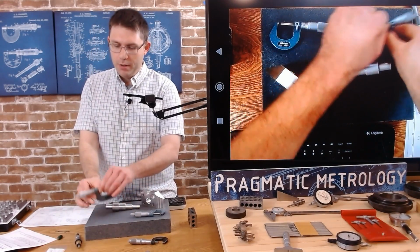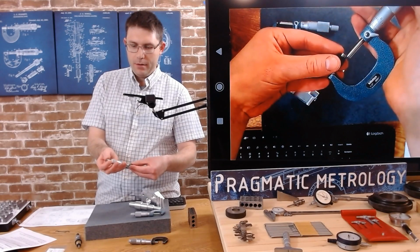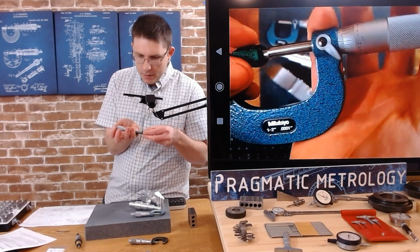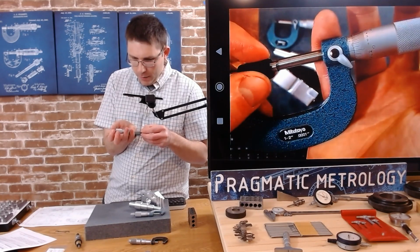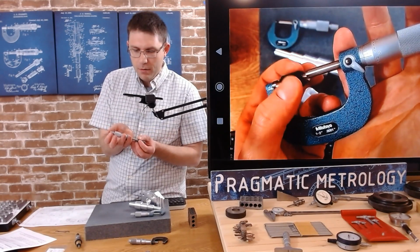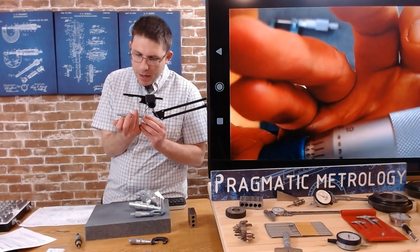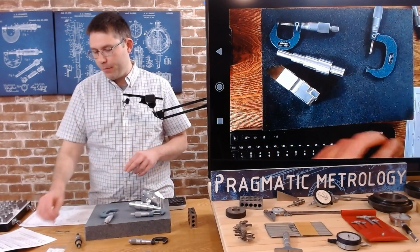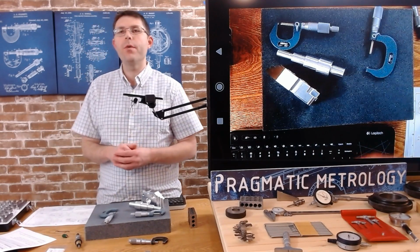When you have a larger micrometer, you go through the same process, but you have a standard in the box that you can check with. And let's see. When the standard spins freely, oh, it snuck out. I'll do it again. When the standard spins freely, we're looking good. And from my point of view, we're looking maybe a 10th high, not even a 10th high. But it's, I think, good enough to use. I could use more gauge blocks to check the range of that one as well, but we're gonna move forward with what we've got right now.